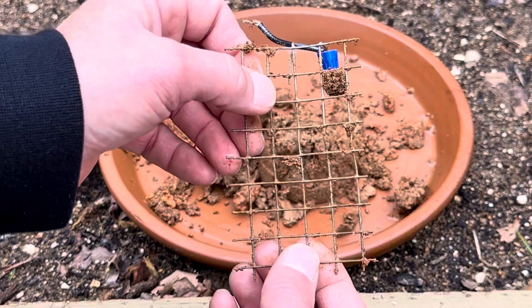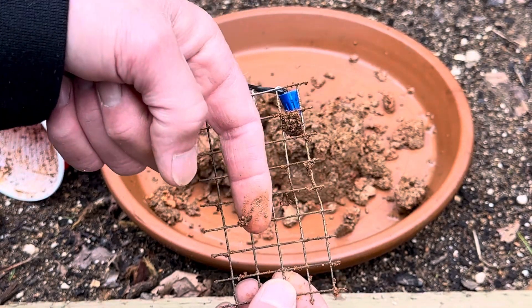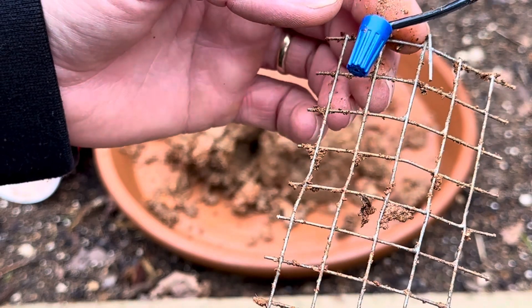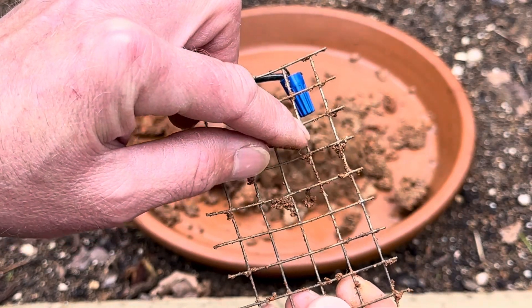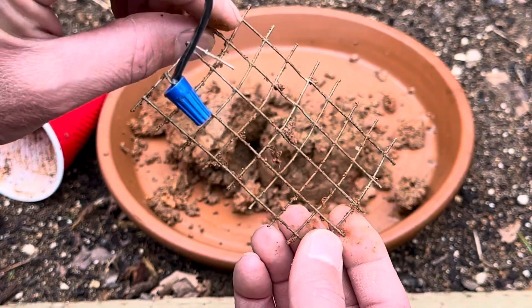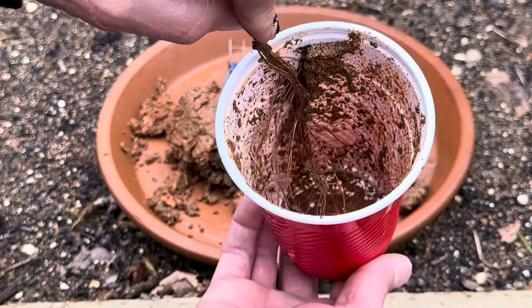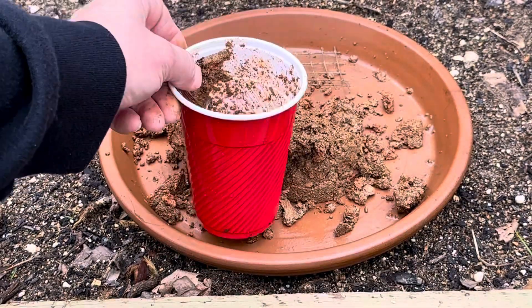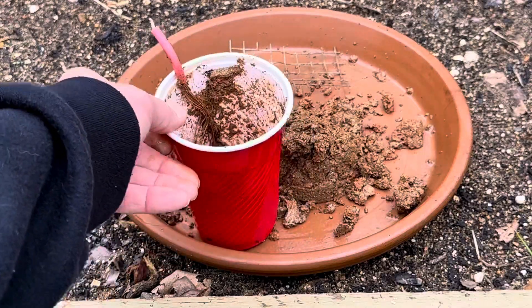And just a piece of hardware cloth — that's galvanized steel. So we're using the zinc right here, which is a very thin layer. If I stuck a rod of pure zinc in there, or lead or carbon, it would do a lot better. This is just a piece of old junk wire laying around. You can see it's still shiny, so that battery would probably make that current for months and months until the zinc was gone and it started going back to iron — it would still make current, but not as much. So: copper cathode on one side, zinc anode on the other side, then fill it up with dirt. You can try it with potting mix or dirt from the woods. Mineralized soil would work better — I had a little bit of limestone mixed with red clay.